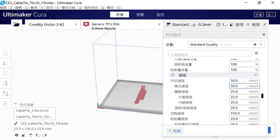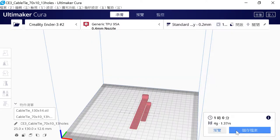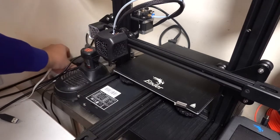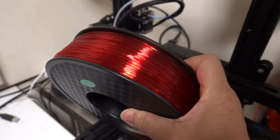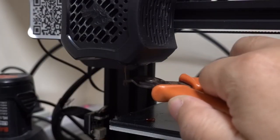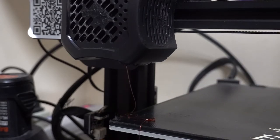According to my previous experience, I changed the printing speed from 50 mm per second to 30 mm per second. If using near-end printing, this setting has no problem. But now I plan to use the Ender-3 V2's remote print head to print this red TPU — good luck to me. Since TPU is really soft, just squeezing out the old material took a lot of time. Please remember that the temperature must be adjusted to about 240°C when proceeding; otherwise it is easy to block the print head.